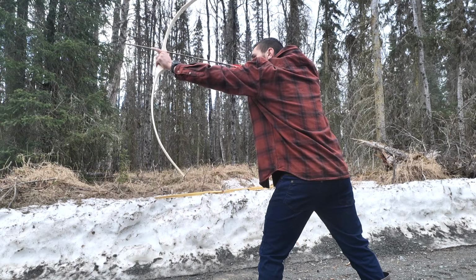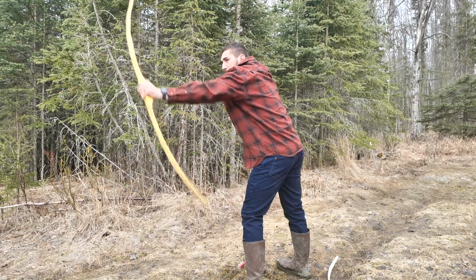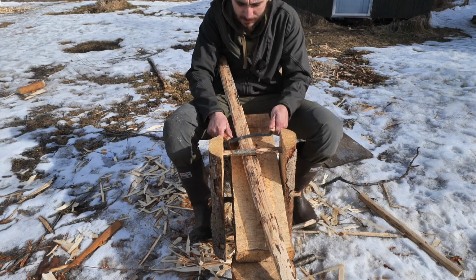I want to find out if I could only use one wood to make the best hunting bow, what would I choose? The nice thing about hickory is that you don't have to chase a ring, you can just take the bark off and then that is the back of your bow.